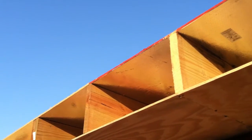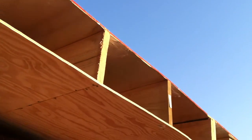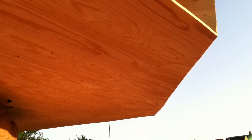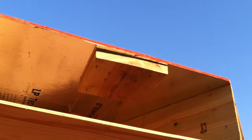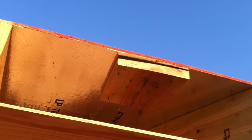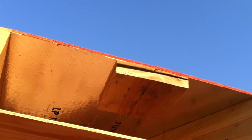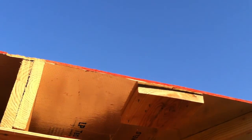Then on the outside I put on this half inch underboard. It's just plywood with one side finished so that it can be painted. I should also mention that in the places where the pieces of particle board and plywood didn't meet, I just put blocks like this. It's a very fast way to link two sheets of wood together.